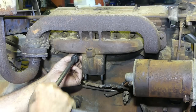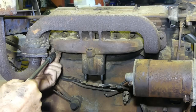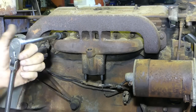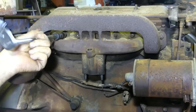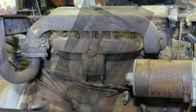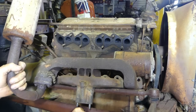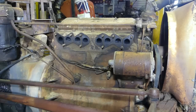A socket would work just as well under here — give me a straight run. These two we won't be able to do like this. I'll get a 9/16 spanner, undo these, and come back off. I've undone the hard-to-get bolts through here, and there's our manifold coming off. Now you can see where it's been all ballsed up through here. We're not going to use this again — I do have a spare.